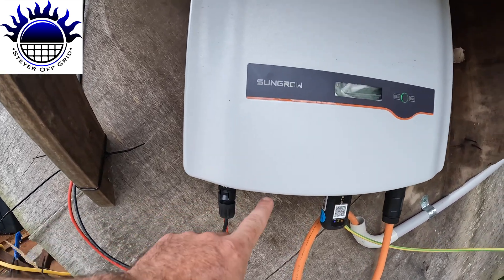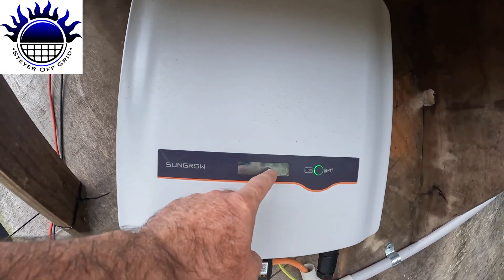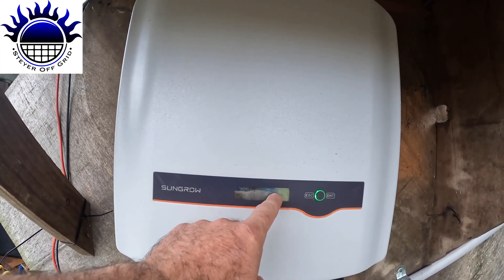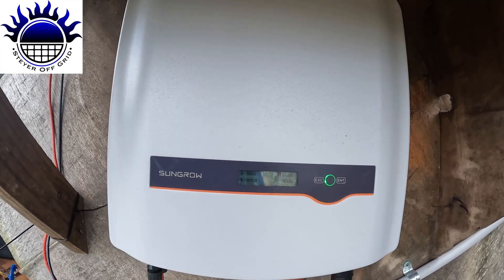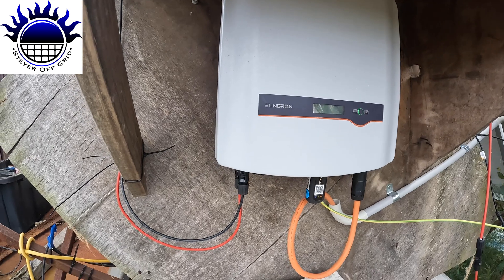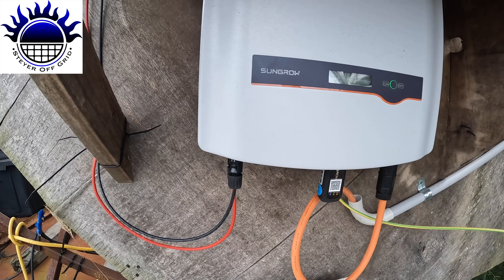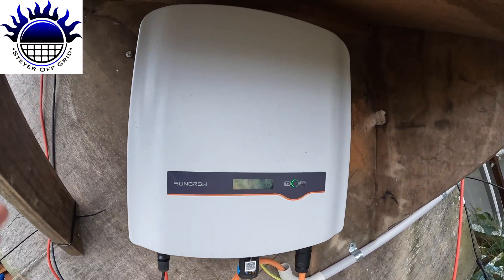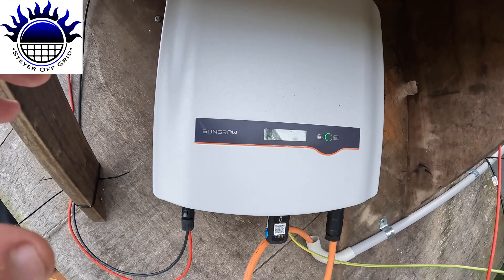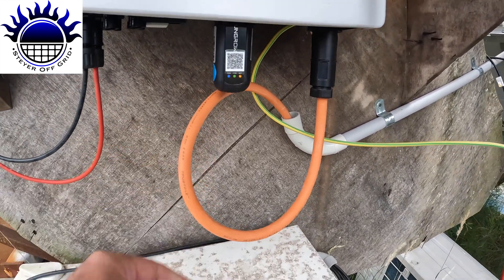You can run 600 volts on each of these tiers. At the moment — it's gone overcast now — so we're only producing 467 watts; we'll have a look at that on the inside. I can run three lots of 20 panels, it's very expandable. The reason I've gone for this system is that it will get moved over to my shed home. This cable goes inside and we'll go and have a look at that now.